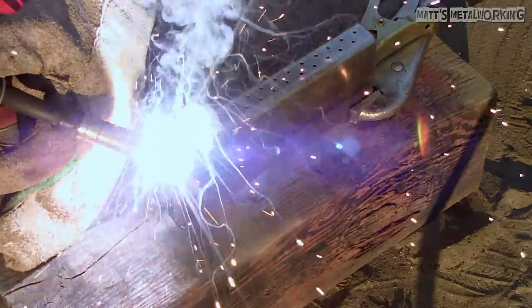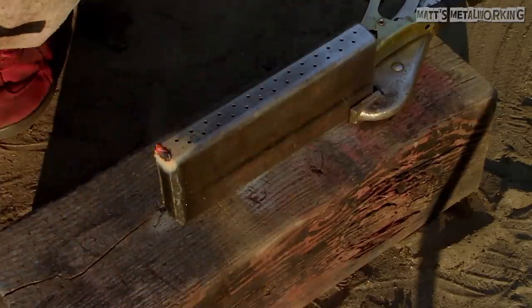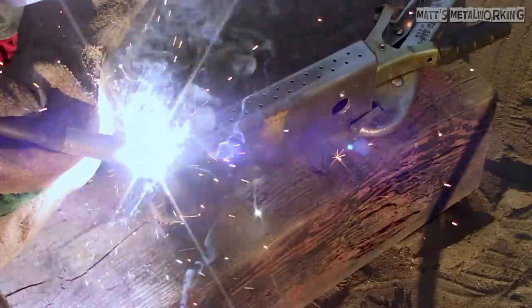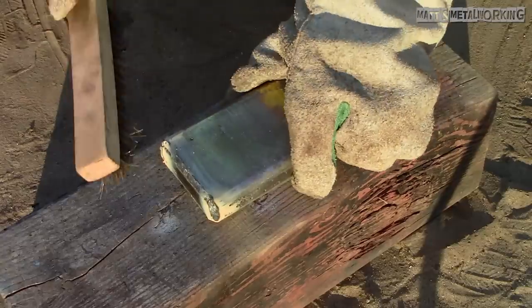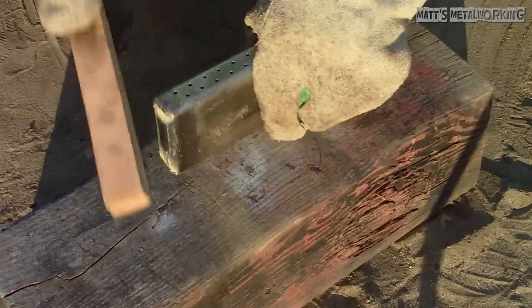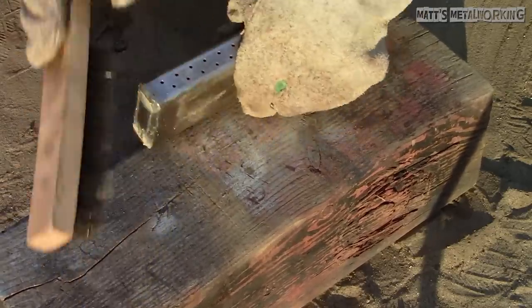The locking pliers on the other side just keeps the workpiece from falling over. As a tip, when there is slag you drag — meaning the tip needs to be pulled away from the welding area so no slag is pushed into the weld. Instead it flows to the surface and is cleaned afterwards. Clean up those welds with a wire brush, and splatter spray can also be used to keep the piece clean — this prevents welding splatter from sticking, which is common with flux core welding.